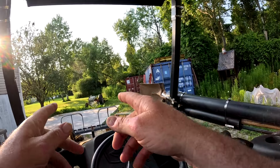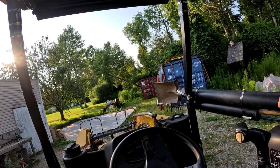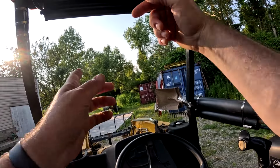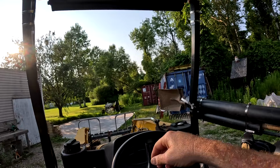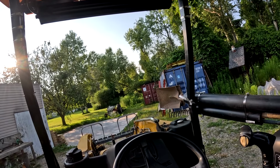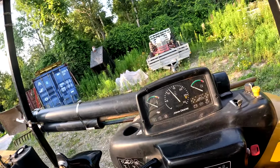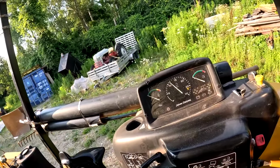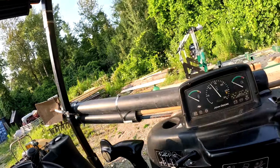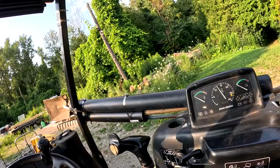So we're figuring for just the walls on this, I need, well, it's about 80, 85 2x6s just for the walls. And there's gonna be a big garage door right here. On this side, we're gonna have like a little man door. And then wall to the door. So we're figuring about 80 2x6s. So we're gonna need more yet. So I'm gonna have to get the longer things on there. They're too short right now to roll off the back.